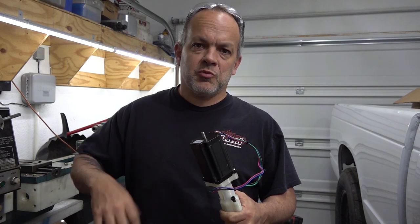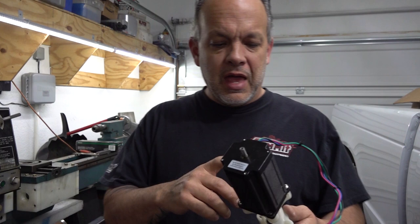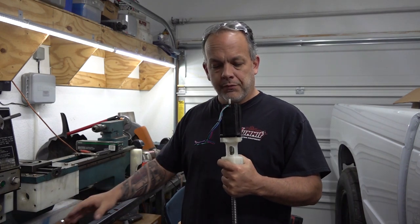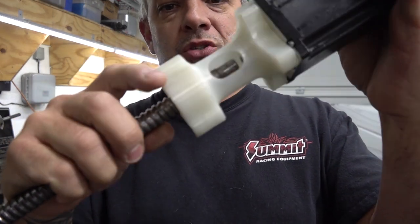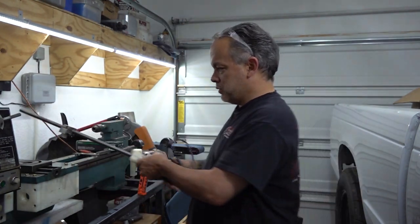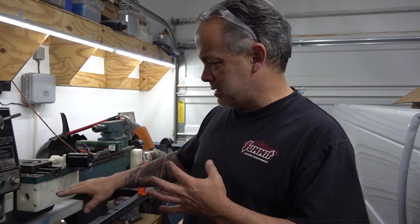There was a little change of plans — this portion of the video is being filmed a few days later. I decided to do away with the x-axis arrangement I showed earlier in the video, where the motor was mounted a bit low and would have used the timing belt and pulleys. After some more measuring and time spent in Fusion 360, I came up with this particular piece — 3D printed for proof of concept to see that everything's going to work. It goes in the x-axis like this and it's going to simplify things quite a bit.